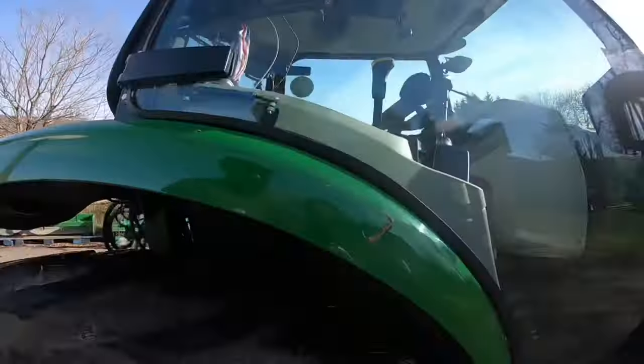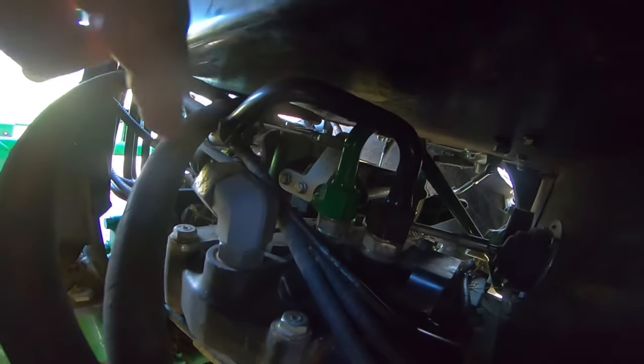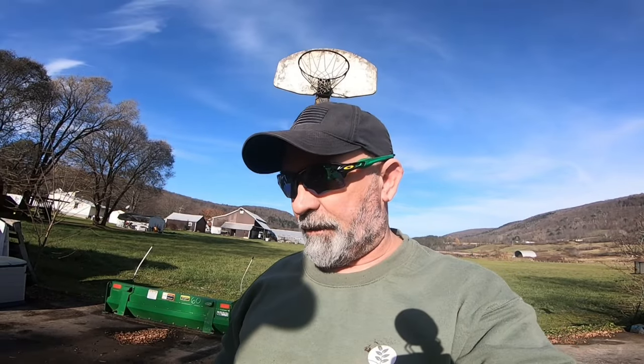By doing that I gained about five inches of lift height on the three-point hitch. The second adjustment — I'll include a photo because it's kind of hard to get the camera in here — is your actual rock shaft valve where the cable attaches. I'll also include the snippets out of the technical manual for that.